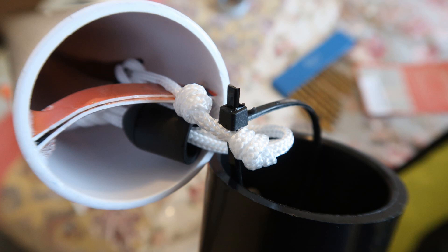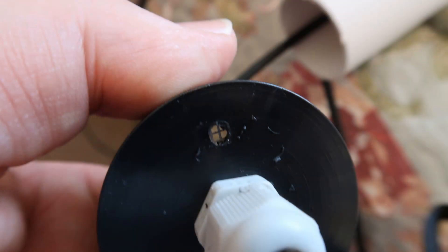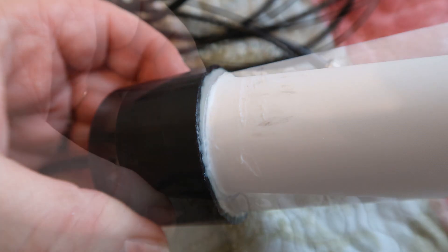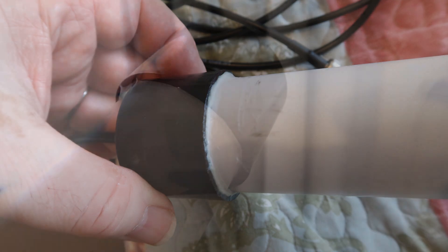Of course, I wanted the pipe to be sealed to keep the weather out. However, this is no easy task, even when using PVC glue, caps and grommets. I therefore took advice from our radio amateur friends, and included a 4mm hole with a plastic gauze to keep insects out. As the heat and cold act on the pipe, air will be drawn in and expelled along with moisture.